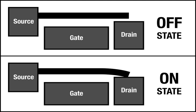A nanoelectromechanical NEM relay is an electrically actuated switch that is built on the nanometer scale using semiconductor fabrication techniques. They are designed to operate in replacement, or in conjunction, with traditional semiconductor logic. While the mechanical nature of NEM relays makes them switch much slower than solid-state relays, they have many advantageous properties, such as zero current leakage and low power consumption, which make them potentially useful in next-generation computing.